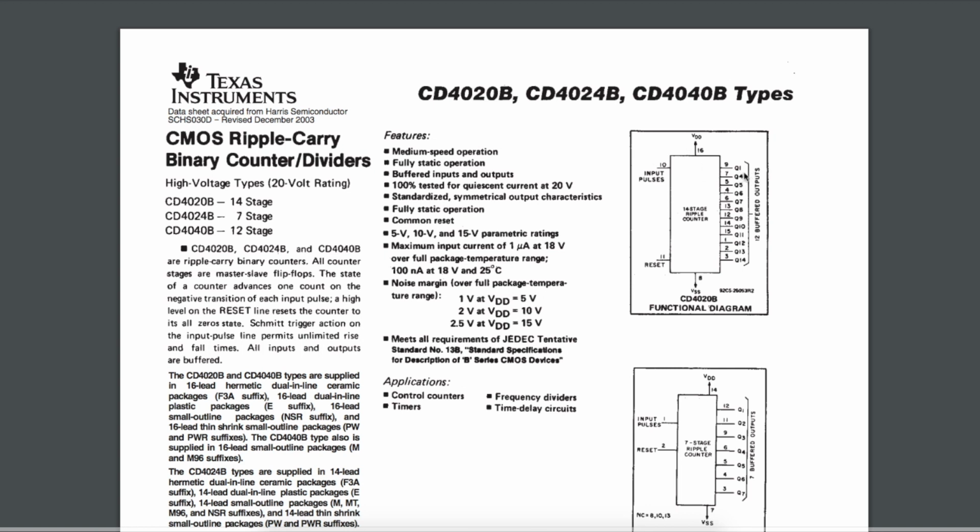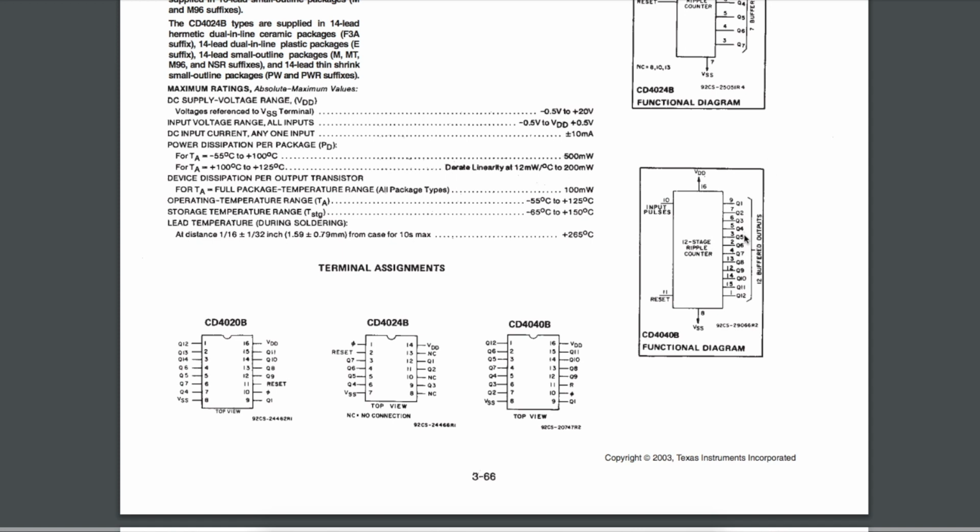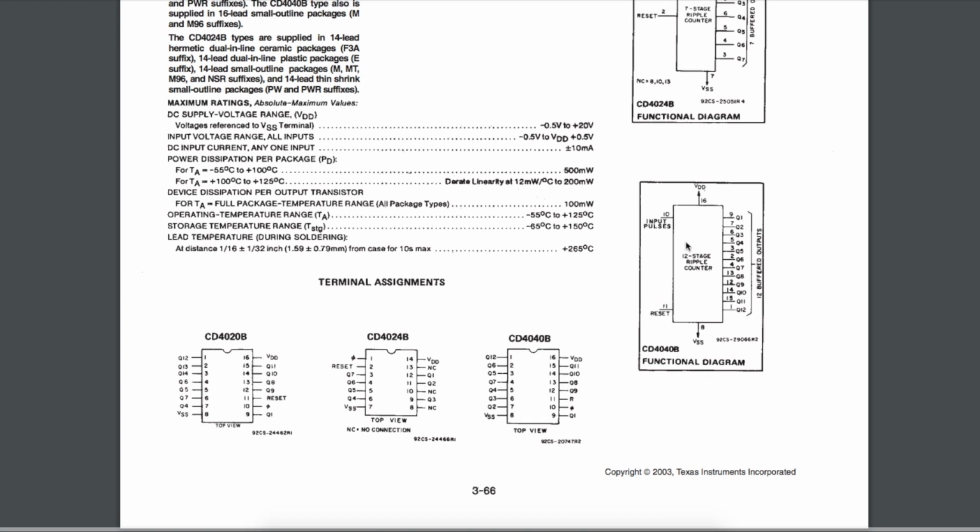Q2 and 3 outputs. What we're really concerned about is dividing it a lot more. So we don't really care necessarily about what's going on in the beginning. We just want a big, heavy division. We'll get this chip. But I want to be able to tap in and get each one divided. So I'm going to use the 4040, so I get Q1 through Q12 with nothing missed. I just only get to go to 12 instead of 14. So however you want to look at it, it's either a binary counter or a clock divider. Either way, standard CMOS 4000 series logic. Good to have collections of parts around if you want to be experimenting with discrete logic here and there.